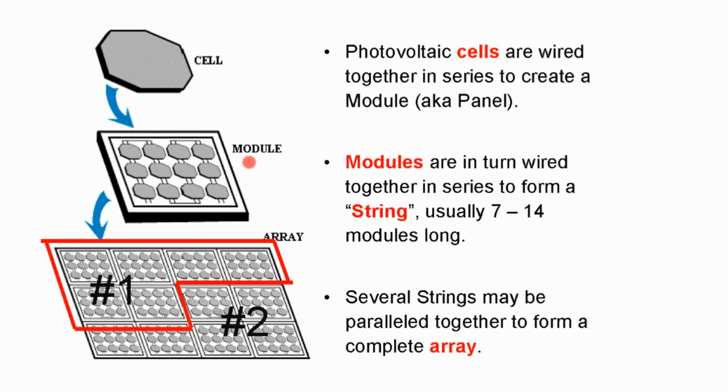And the reason is that the term panel already has other meanings. It could be an electric service panel. It could be an energy distribution panel that the solar array is tied into. I could have a solar monitoring display, and I could call that my monitoring panel, or my solar panel. So if you want to be technical and maybe solar nerdy, referring to the solar panel itself as a solar module is a little bit more clear, whereas the panel technically would be a grouping of modules. So, a solar module is a solar panel. A solar panel isn't necessarily a solar module.